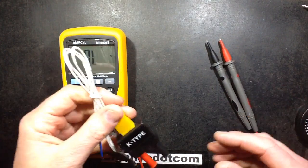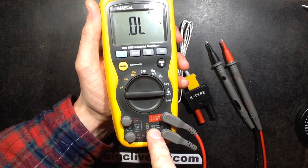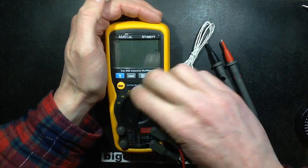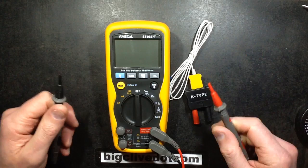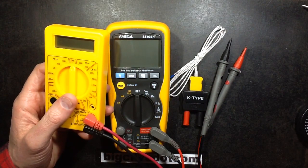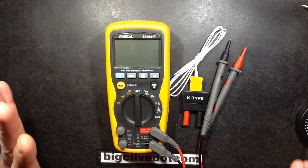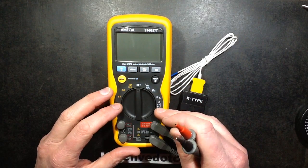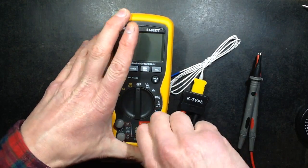It has a temperature facility and comes with a thermocouple, and also comes with plugs for the 10-amp range. One of the main features is its safety rating: it's got Category 4 protection up to 600 volts, and Category 3 to 1,000 volts. That's important — it basically means that if you stick it to amps and connect it into a three-phase power supply or distribution equipment, whereas cheaper meters would literally go bang — flames, everything coming out the sides, burning your hand or face — this one with proper protection has large HRC fuses inside that will break the fault condition in a controlled manner. You'll have an expensive fuse to change, but it's better than having your face blown off.